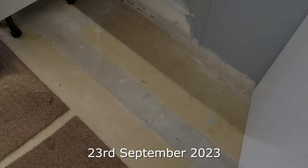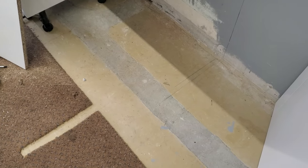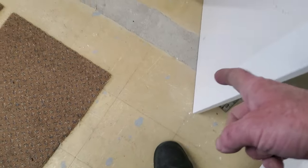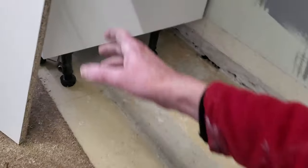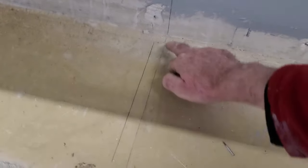I was going to cut the side panel crooked to match the floor because the floor is not level, but I can't cut it crooked because the bit I'm cutting I want up next to the worktop. The bit that's not cut I want next to the floor, and that bit of floor is a bit high here. So all done - I've marked out where the board is going, I've got a spare piece of chipboard, put it down, draw the other line. I'm going to just take away a small bit of this tile here, probably as far as there, and that will allow this to go on level.